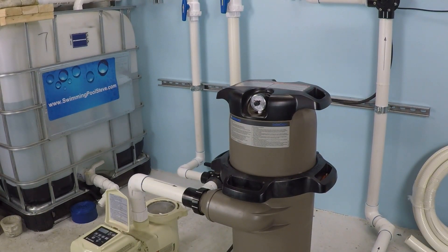As you saw there, when you get towards the higher RPMs, the amount of power consumed goes up drastically, but you're only getting a couple more gallons per minute each time. That's because as you turn down the RPM of the motor, there's a linear drop in flow versus an exponential drop in power consumed — and that is the entire premise behind variable speed pumps. That's why you should buy one, and that's why they save you a lot of money. If you found this helpful, please like this video, subscribe to my YouTube channel, and check out my website, swimmingpoolsteve.com.